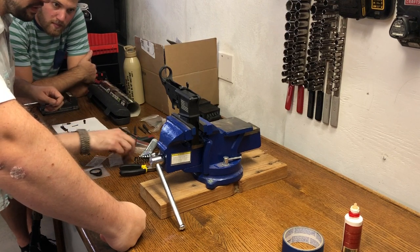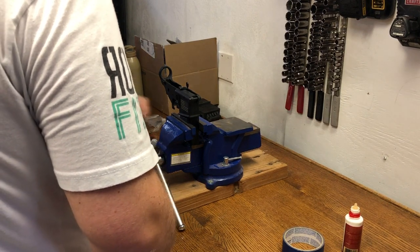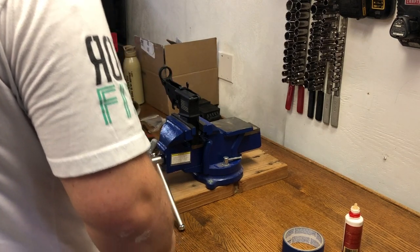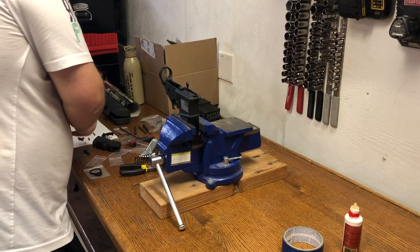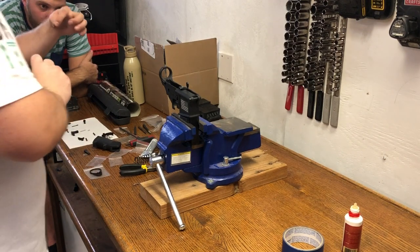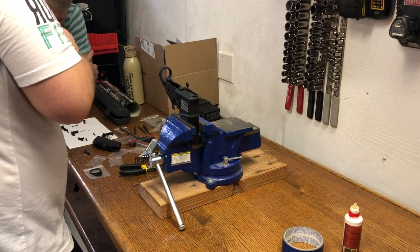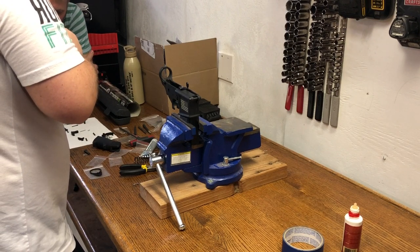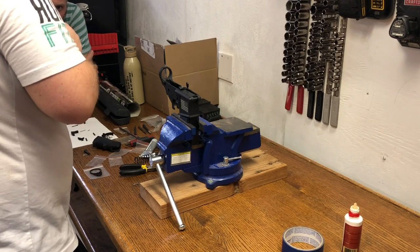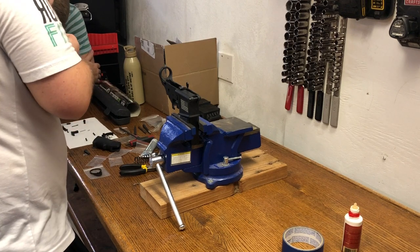Okay. And that's where having a punch just to get it in there, punch it in place. I would put the punch in from the back to get it in place. And then we can work on putting the pin through, and then the punch will just fall. Okay. Perfect. So then I would put the spring in. Good, put the spring in now. That little part there. Excellent.